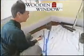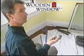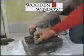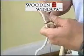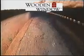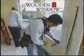Okay. Well, we just happen to have these specially made lead weights that we have made. Nice. That will add to it until we get the right amount. You want to figure it out? We add the additional smaller weights until we reach the sum of the window's weight. Perfect. Look at that. Next, new nylon ropes go in, using a weighted chain to thread them through. Time to let the experts take over for a while.